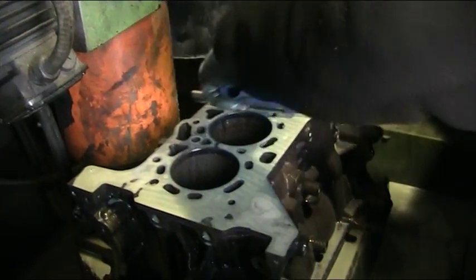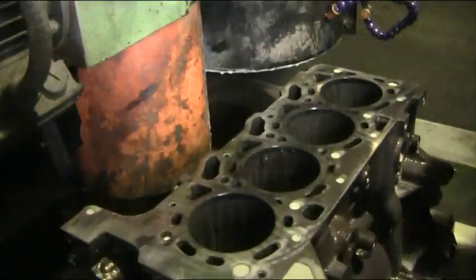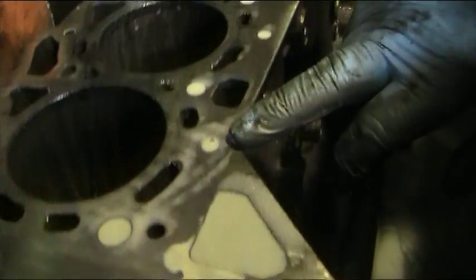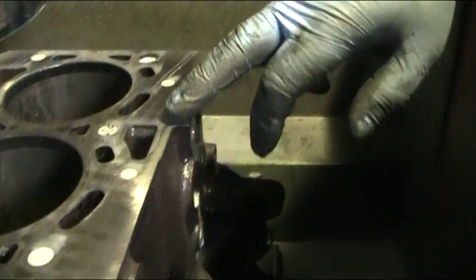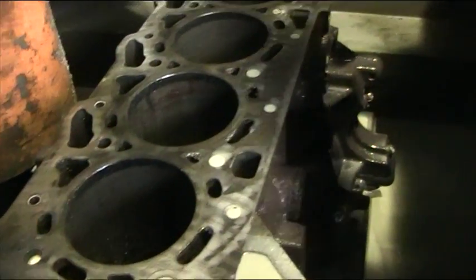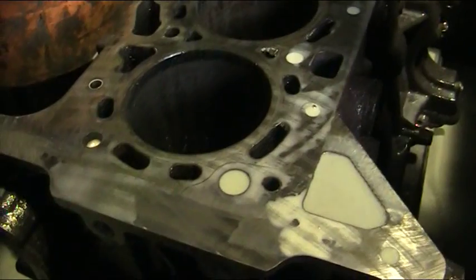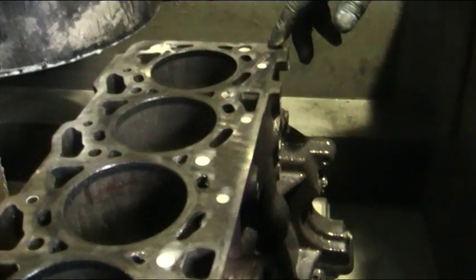Look what we've got. I hope you can see with the camera that the machine has caught the block here and here. These zebra stripes are the original factory finish — our finish is a bit smoother than that — and it's caught it here and here, so that's telling us this crank casing has a bow in the middle. It is excessive, but it's not unrepairable, and that's a lot of what we do here. We make things right that need a fair bit of work. So we'll carry on refacing this and show you the finished result.